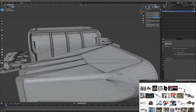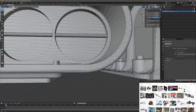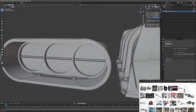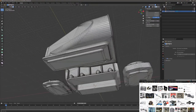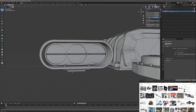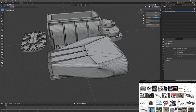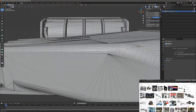Yeah, I'm pretty happy with this. I need to exaggerate this butterfly a little bit more, though. It doesn't print very well. But I think that might be also because I'm printing it vertically instead of horizontally. So I'm thinking I might rotate it up to print it. Or what I might do is, hey Dominic, I might break this out and print it in a different orientation. This face here is smooth, but when it prints, you see the layer lines. But I kind of like the way the layer lines look, so